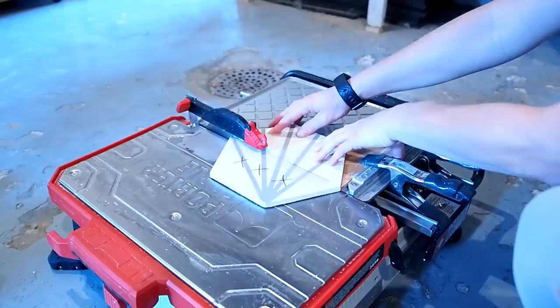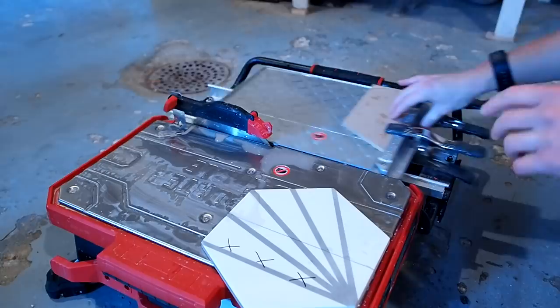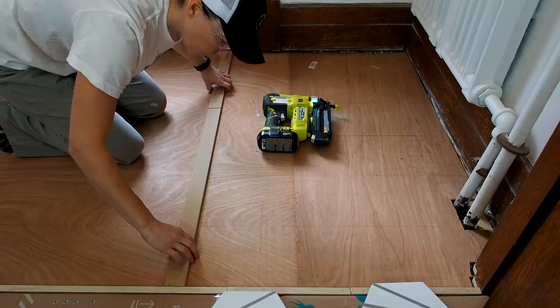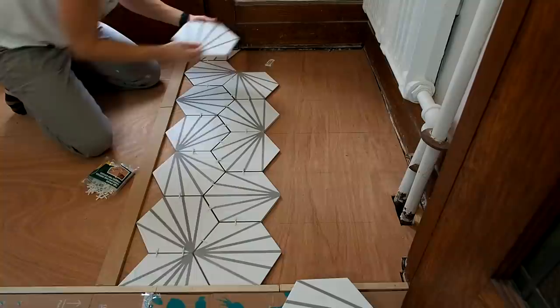The same applies when cutting in this direction — there's not much to support the back edge and it can easily move out of square, but using a wedge helps solve the problem. Just clamp it in place and test it to make sure the clamps don't get caught up on anything, then making the cuts is a breeze. Here's tip number six: you can nail a ledger down to create sections and work one small section at a time. Here I'm doing another dry layout of this small section so I can see what cuts I need to make and precut all of my tiles — I don't want to be running to my tile saw while my glue is drying out on me.